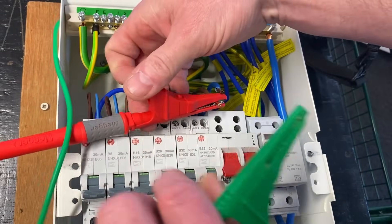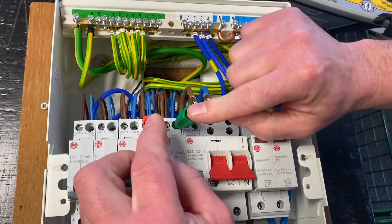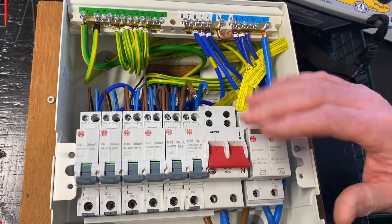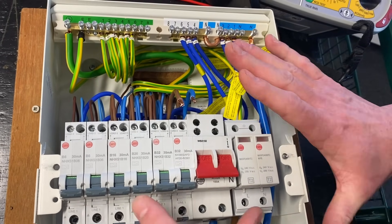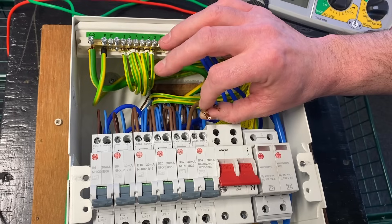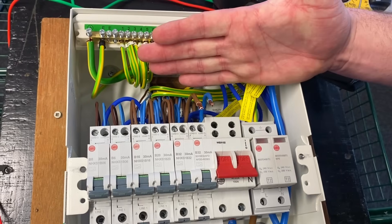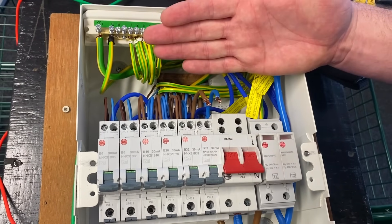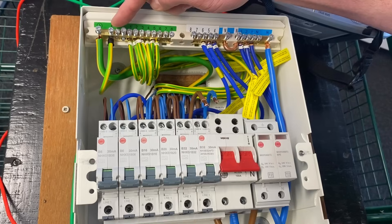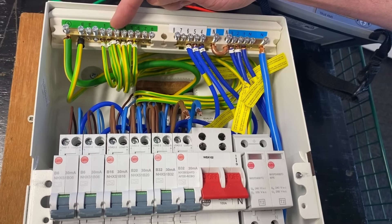I can now press and hold my button and I've got a reading greater than the machine can read — greater than 999 megaohms. If I wanted to test between live conductors, I just disconnect those and test between line and neutral, recording a reading again greater than the machine can read. The important point is that my circuit protective conductor was connected to my external earth source and protective bonding during the insulation resistance test. It didn't matter that the live conductors were disconnected if I was worried about AFDDs or the surge protection device. As consumer units become more complex with electronics, people may choose to disconnect live conductors and carry out the insulation resistance test, or do it as part of the installation process — as long as the earth bar has the appropriate connections in place.